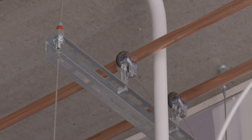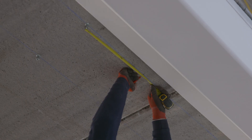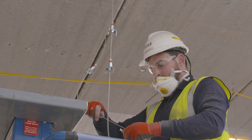A typical install would be: you get your drawings with your dimensions from the architect, you come out onto the job, you mark out where your brackets need to be, your containment run, and then you mark out your holes for the Tapcon bits. You drill the Tapcon bits, then apply the Gripple wire, and then your containment straight on top of that.